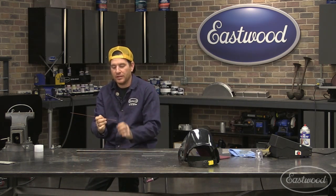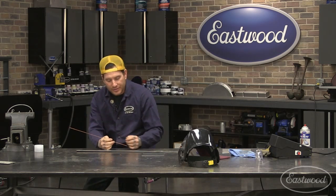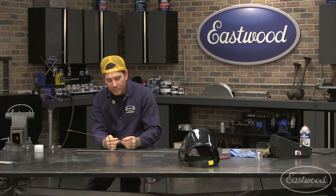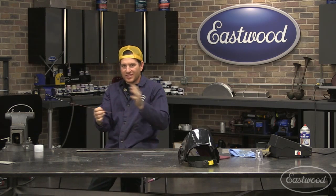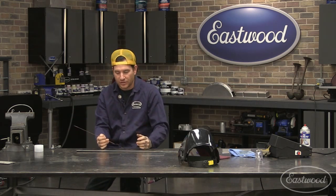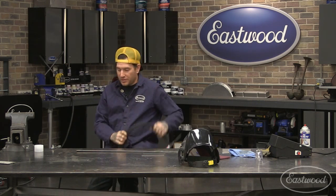So choke up on it, leave maybe 10, 12 inches hanging out at most, and then you can just feed as you go. Some guys like to hold it even closer than that, but anywhere in that 6 to 12 inches is totally okay. It's just that you want to keep it nice and steady. So just practice feeding your filler rod as you're working. Any questions before I jump into doing some welds?